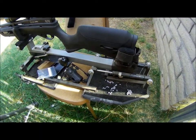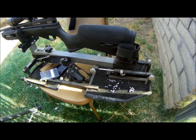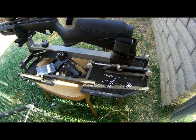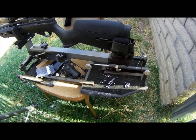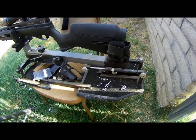I did some preliminary tests and found that the first batch I had cast didn't print quite as well as the second batch. I believe this is because, if you recall, on that first batch I wasn't pinching the two halves of the mold tight enough together, and so I was getting flashing on the seams.